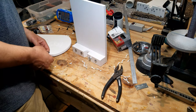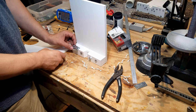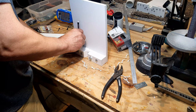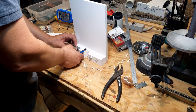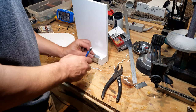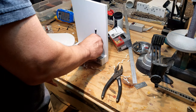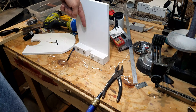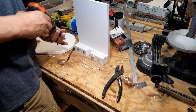I'm going to mark the holes to pre-drill for these hinges and set the hinges on here like this. You can see how the holes going this way are going to miss that bolt because of what we did earlier. I'm going to leave about an eighth of an inch here and mark a circle. The way I'm positioning this hinge, it's going to rise above this a little bit, which actually is not a problem - and it allows these holes to be centered on this piece of material, not more towards the edge. I have the appropriate size drill and I'm using a small screwdriver because my hand drill is too fat to allow me up against that. It happens to be just the right length to pre-drill.